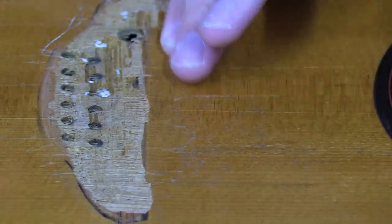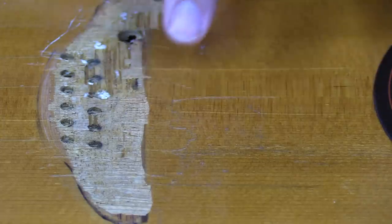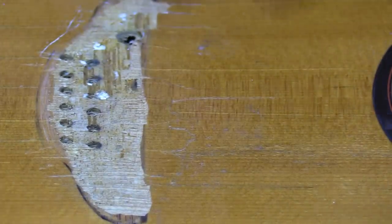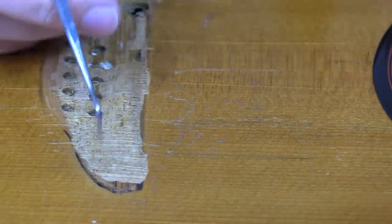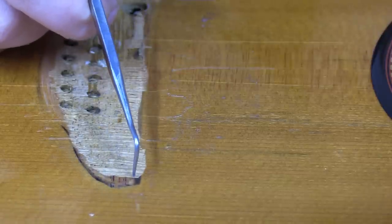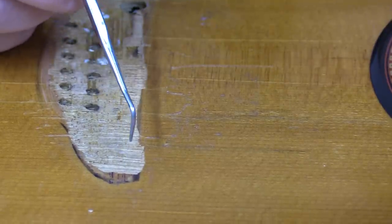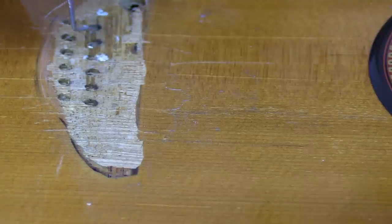What I'm thinking right now is doing some light sanding to smooth any sharp edges — you can actually hear it on the finish. I think I'm going to put the bridge back where it was. I'll obviously remove any finish that's underneath the bridge. This finish underneath is what causes bridges to come off — they're glued wood-to-finish instead of wood-to-wood, and the finish just doesn't hold. On top of that, 12-strings need to be glued really well because there's so much more tension on them.